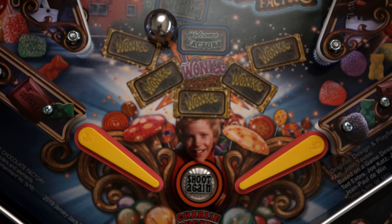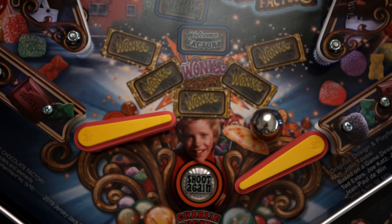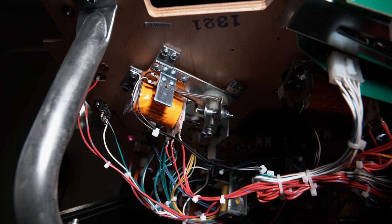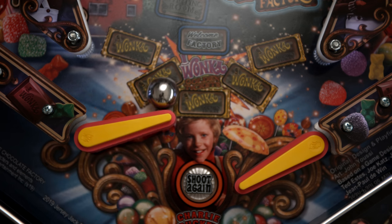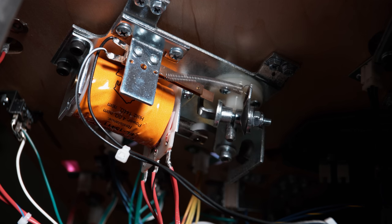Heading down to the flippers — the classic area of a pinball machine. Press the button, the flipper moves, hits the ball away. It's a very strong mechanism and there are actually two circuits for the flipper — it's a solenoid actuating this arm. There's a circuit for the initial high power burst of current needed to move it, and then a separate lower power circuit to hold the flipper in place if you want to hold it up, so you're not running high current through it constantly. When you physically press the flipper button, a little piece of plastic pushes against metal leaf switches inside. When one piece of metal knocks into another, it completes the connection.